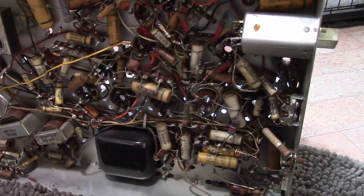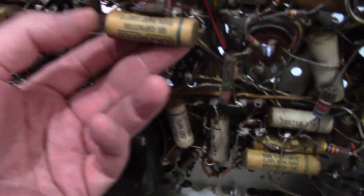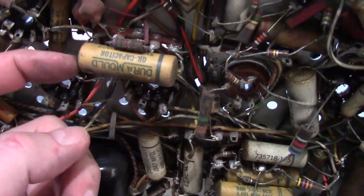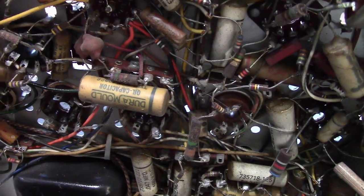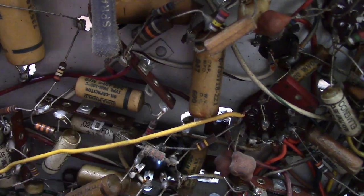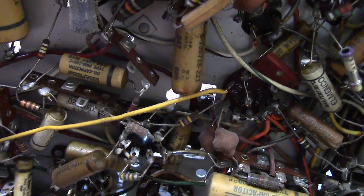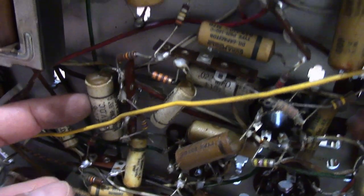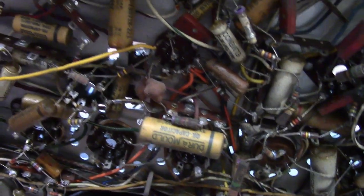Other than that, honestly, I don't think I would take much of anything else down here. We have a ton of paper caps. If you wanted to re-stuff caps, that's your thing, although these are durable mold type — the ends are almost like cement rather than wax. They're oil inside — paper impregnated with oil and then metal film. More reliable perhaps, but these are all still going to be leaky. And then there are a few with a ceramic housing — all virtually impossible to re-stuff. As far as still being good and reusing them, no, I wouldn't. Same goes with the carbon comp. Maybe the mica capacitors — maybe.